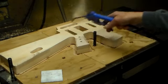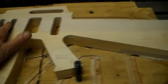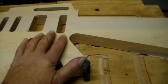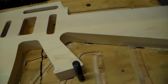Our next step will be to turn the part over and do some machine work on the backside. I need to pocket out on the backside to gain access to the humbucker and the two single coils, and do a route to the location of the output jack which I'll fill in later with a strip of wood, and machine out this area for the volume and tone pots.